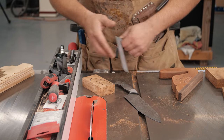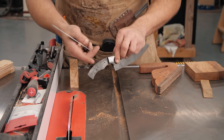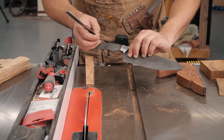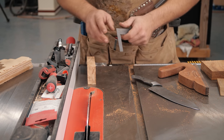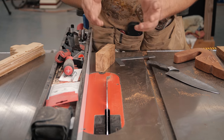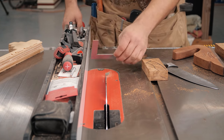Now that we have our holes drilled, we're going to want to release two of our scales. From experience, I want to do that close to the depth of my ferrule here. There's an old adage on the internet: if you want to know the correct name for something, say the wrong one and the internet will correct you. This is 3/16ths here. I'm going to do it a little bit over 3/16ths because I want some room for sanding. If you're uncomfortable making a cut at 3/16ths on your table saw, you could do it on your bandsaw with a handsaw, or you can leave this really thick and bring it down with a hand plane and sandpaper later. So we're going to set our table saw, release two of these, and then glue this thing up.